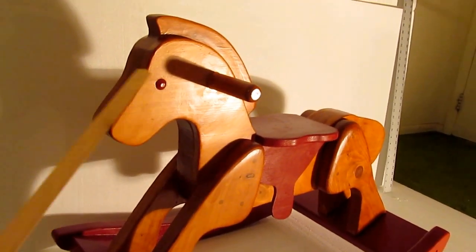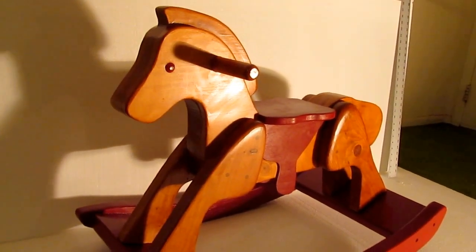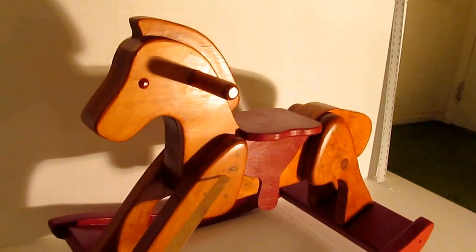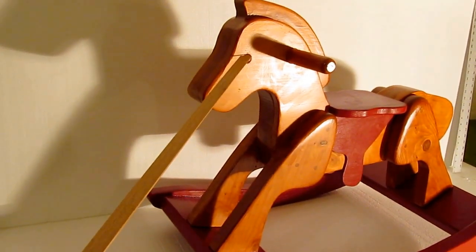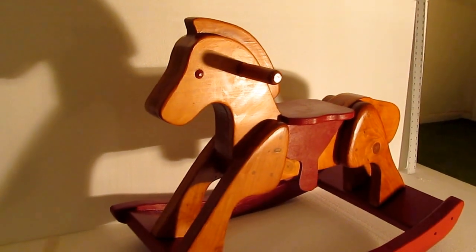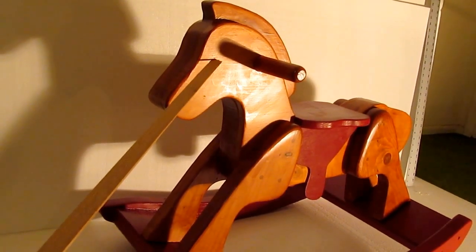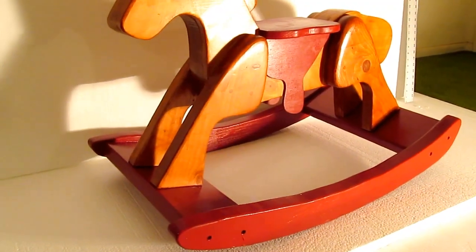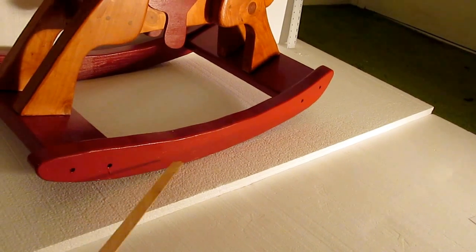In the plan they bored a hole through the outer piece for the eye and left it that way. I wanted to screw the outer piece to the two-by-ten, so I did that in four places — a screw behind the front leg, behind the back leg, behind the saddle, and in the eye. I bored halfway through, put a screw in — it's also glued, as suggested — then filled the hole to cover the screw head with a piece of dowel that I painted red.